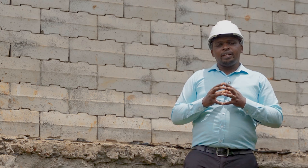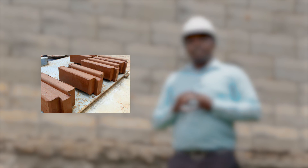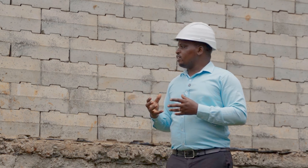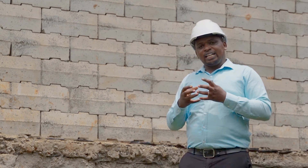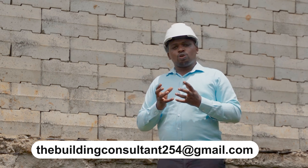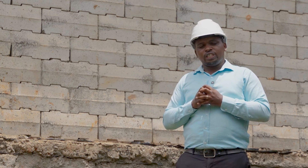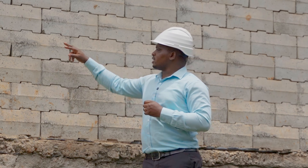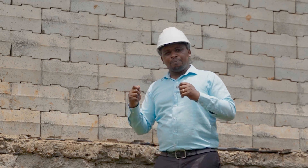Normally the blocks are made either of stabilized soil or lightweight concrete. The block we have here today is made of light concrete. You can either manufacture the blocks using light concrete with some cement, or prepare them using soil stabilized by adding cement into it. The purpose of the cement is to hold the particles together so the block does not disintegrate. Cement content is very important — if the content is too little, the edges may begin to disintegrate. To produce a robust, strong block, you will need a higher cement content.